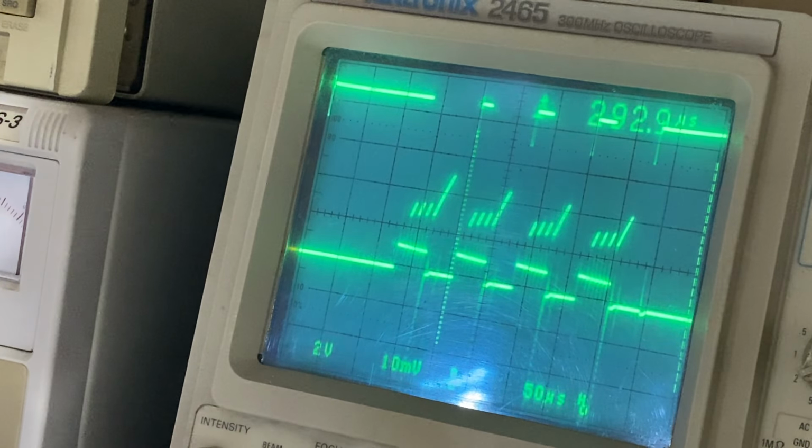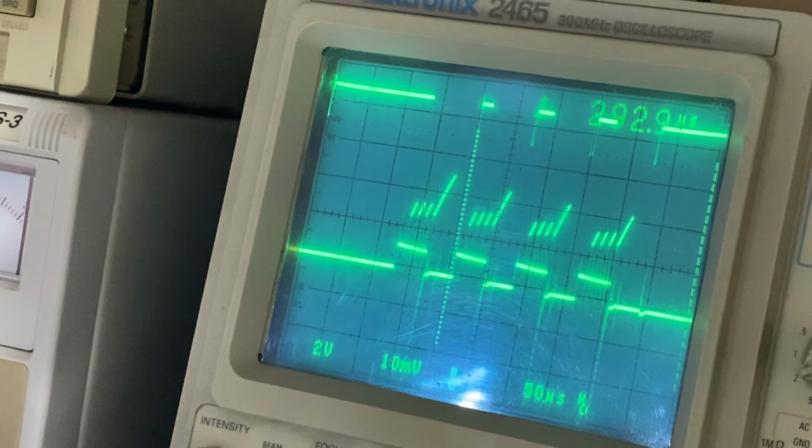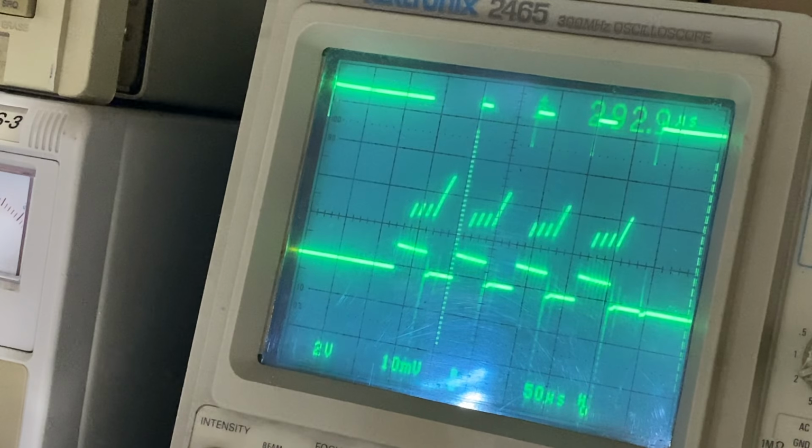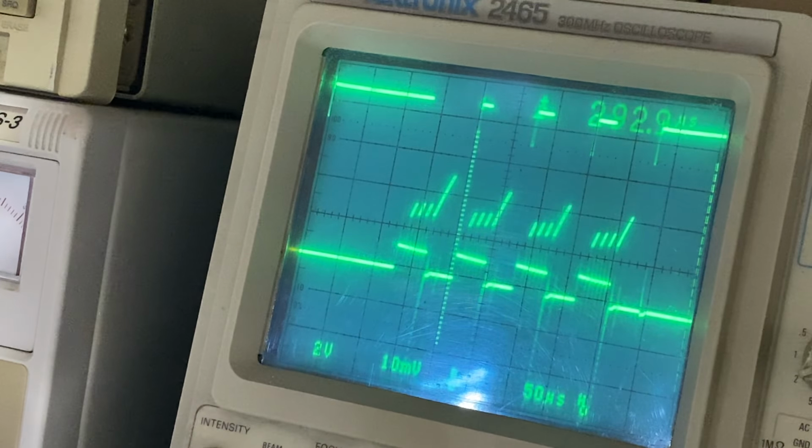If you've noticed, I don't know if you could actually tell, but the detector is a hell of a lot quieter. I'll turn up the volume. It's still noisy because that coil's a bit skew-whiff up there. And the detector will be more sensitive because we've got rid of all that racket appearing in the receive window. There is a little bit of overlap there on the end part, but I think it's in the dead time.